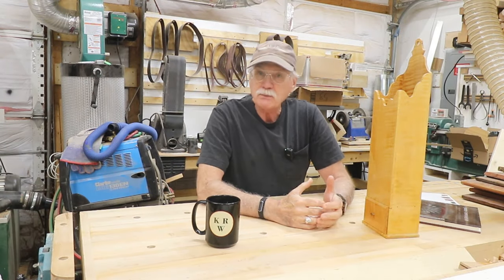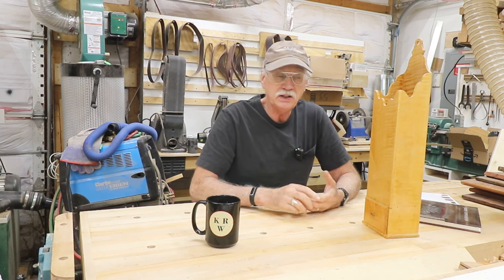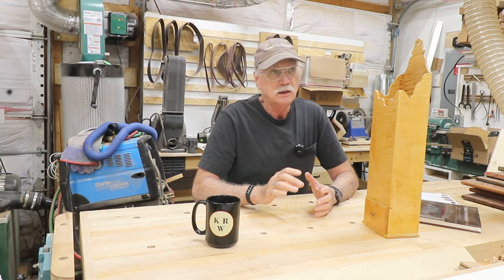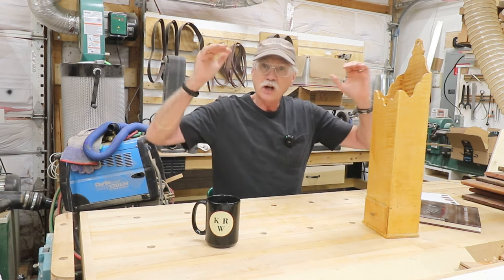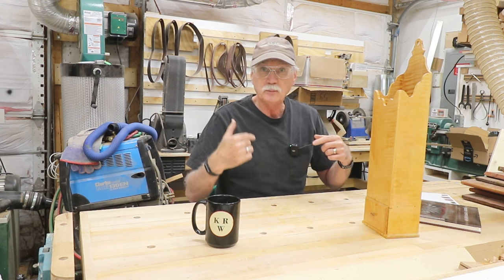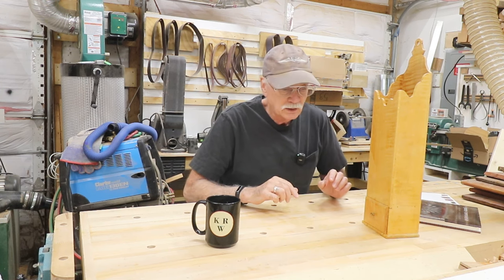Now that you have a good idea of my inspirations and where I'm going with this piece, let me talk about the construction. I want to do as much period style construction as I can. When I say style, there's going to be a lot of machine work done, but anyhow, that means top and bottom and sides are going to be dovetailed together with blind dovetails. The drawer fronts will all be blind dovetailed to the sides.